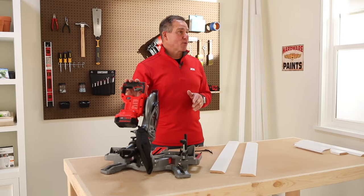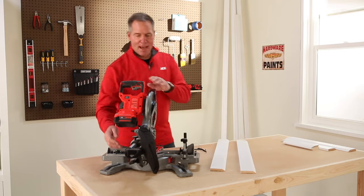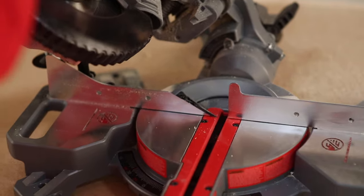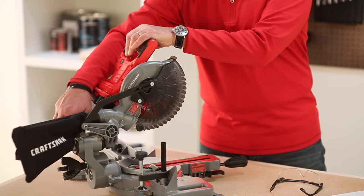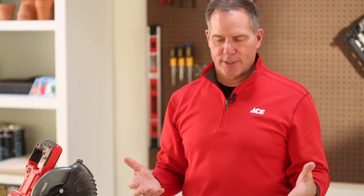So if you're looking for an excuse to buy a new power tool, this is a good video to watch. We're going to be talking about cutting inside and outside corners when it comes to base trim. I'm using a compound miter saw — this is actually a battery-operated one by Craftsman. It's a slide saw; it not only cuts back and forth but it slides, and that sliding action allows you to cut larger materials.